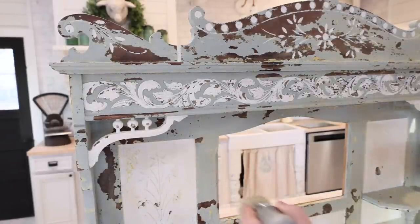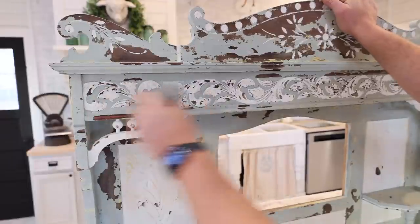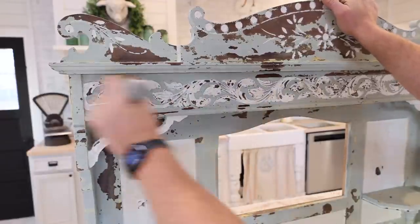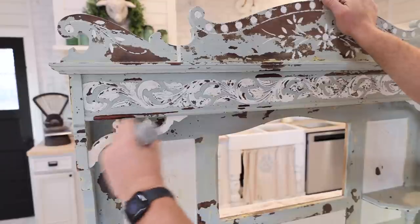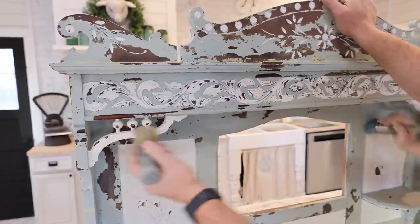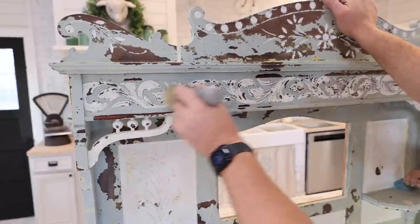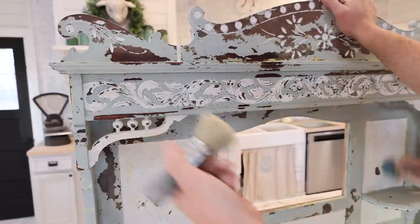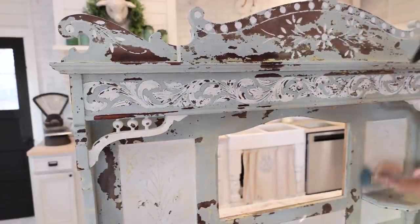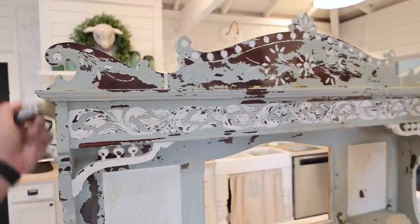We're using Sweet Pickens beeswax in clear. We're gonna clear wax this first, that way it gives us a good base, because when we do colored waxes, which we are going to be doing in a minute here, if you have a clear wax base, it really helps you control how much that wax goes on there and where it goes. If you get somewhere you don't want it, it wipes off easily. Whereas if you just go on straight with the dark wax first or the white wax, that's gonna sink into the paint a little bit more and be hard to control where your wax is,